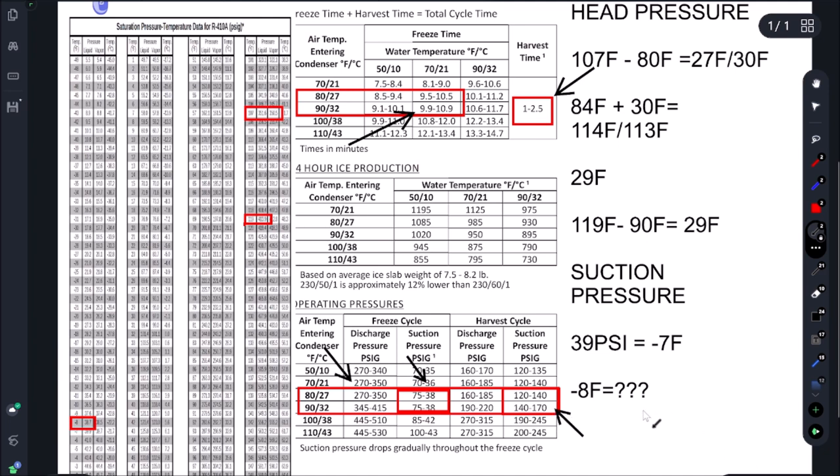It's really important to use these charts. The hold times when calling tech support are long right now, but pull up the chart while you're on hold — if you can make sense of it, you might not even need to call. The importance I've been stressing to everyone: learn the equipment, read the service manuals, take a chance at the equipment before calling tech support, educate yourself and everything becomes easier. I'm by no means a Manitowoc ice machine expert, but based on the chart John sent me and all the troubleshooting, I was able to figure everything out with my PT chart. And I didn't need a stopwatch — I love the feature where they have the T1 through T4 probes and how they're timing the freeze cycle now. These are great little things they've integrated into these new machines that are just going to make our lives a lot easier.